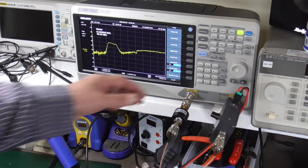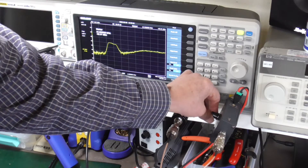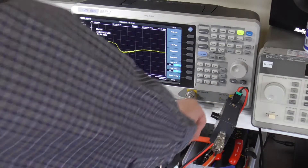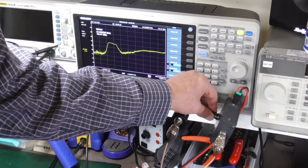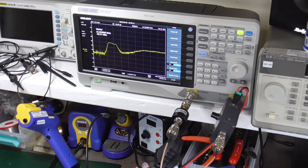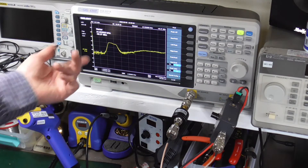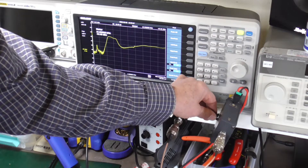But the gain control just doesn't work for me. Even when I back it off, it goes to minus 10 permanently — then eventually it resets and works again. It just gets into this mode where it wants to stay at minus 10. I don't know what's causing it. It's not usable in my opinion the way it is now. It might just be a resistor issue, but when I back it down to about half gain, sometimes it recovers — so there's something else going on in the circuit that's just not working well. Sometimes it works, but I can't depend on it.